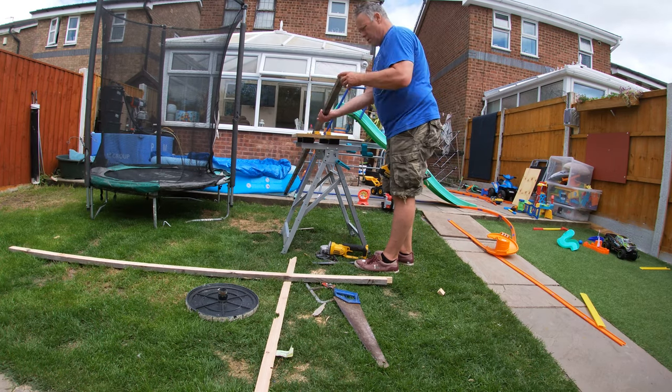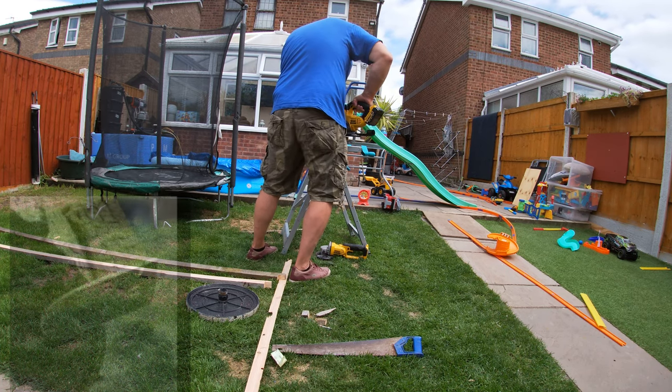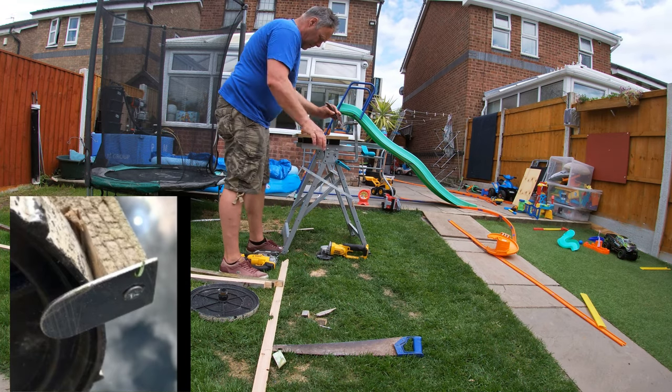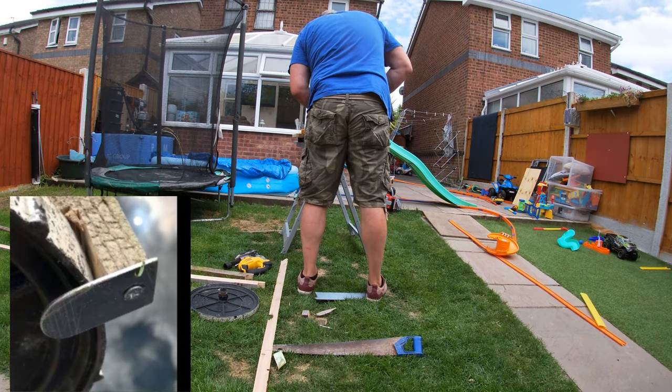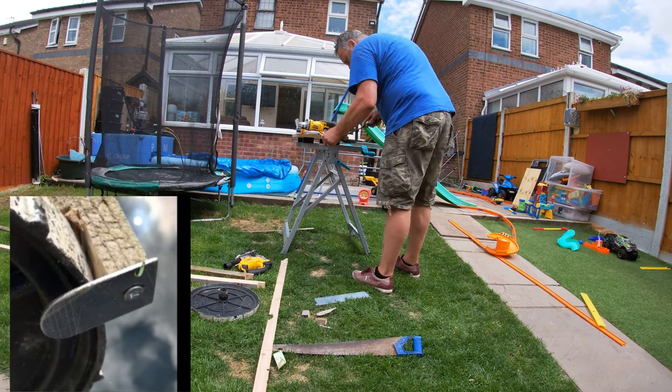As I wanted to use the tongs to get the cover as close to the bottom of the drain as possible, I made a very thin profile at the bottom, out of a stainless plate. Cut it and shaped it using the jigsaw, countersunk a hole, and then screwed it into the bottom of the tongs.